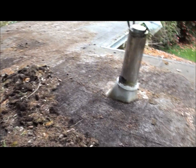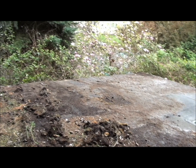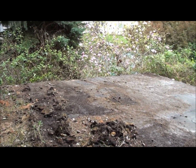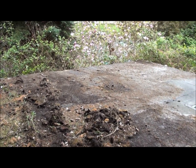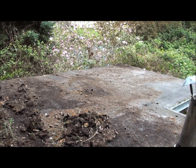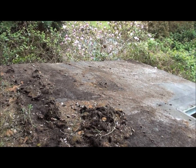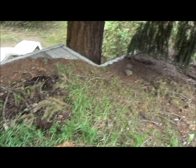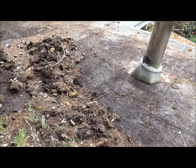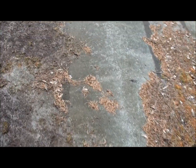And this roof on this side, this summer, definitely going to get a repaper. It needs a couple boards way over there on the far side on the corner. Some of the paper's torn back, and the plywood underneath is a little bit soft, so I'll go ahead and fix that and throw another layer of paper on here. But the old roof has done me well. It's been here since I bought the place, and it was old when I bought it.